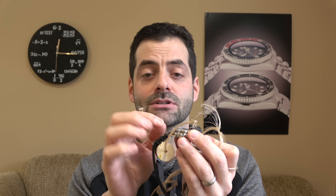So a factor of safety of probably at least two — really impressive when you think about it. These watches are meant to pass the spec, and they're using what they call Seiko fat spring bars. They're super thick — they hug the strap really nicely when you slip it through the acceptance hole in the end of the strap, and ditto when it goes into the end lugs. Would standard 1.5 or 1.8 millimeter spring bars pass the same test? I really hesitate to say yes. Failing at a lower number doesn't mean it's an inferior product — it's just not made to qualify for the ISO 6425 dive watch standard.